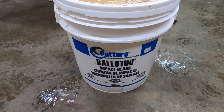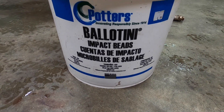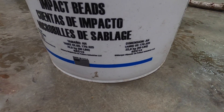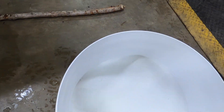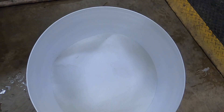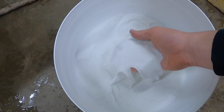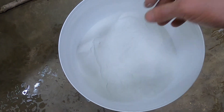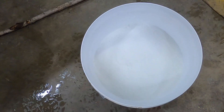This is the glass bead that I got — I got it from Grainger. It actually comes out of Pennsylvania. The dimensions are 170 to 325 grit, but this stuff is really nice. You can see this crystal clear glass bead — it's so smooth in your hand, it's crazy. What's really nice about vapor blasting too is that you don't have any dust. Silica dust is a hazard, so having the vapor blaster is amazing.